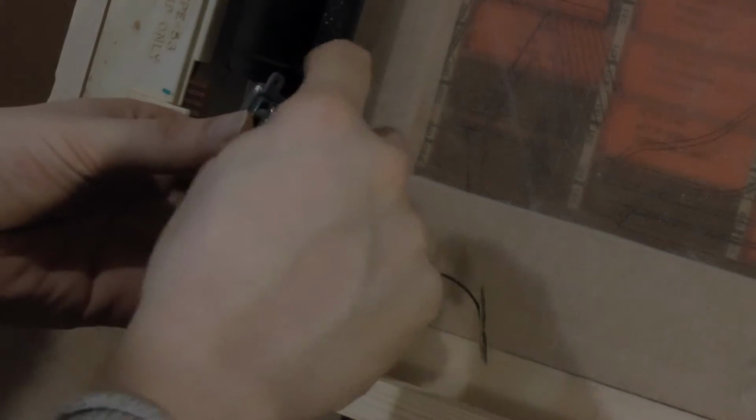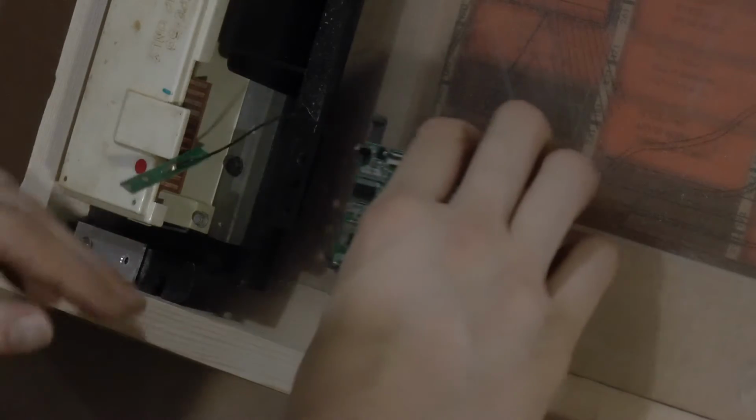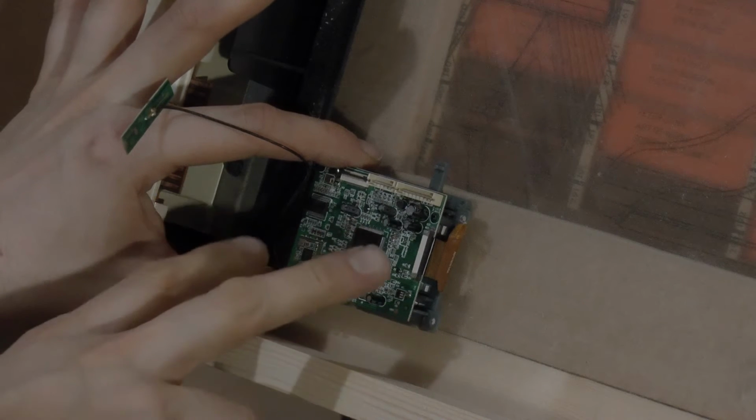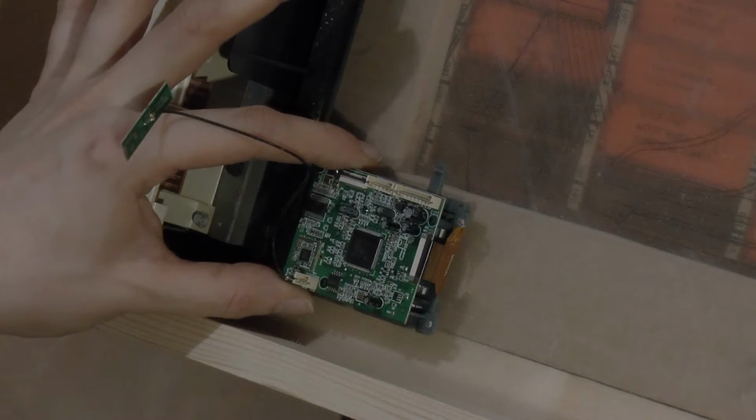But I've got to find a way of mounting it. Right, there's a few ways I could do this, but I think this is going to be the best. This is the indicator lights for the record now playing. I'm thinking a piece of right-angled aluminium bracket bolted to the side of this screen, and then we'll make that up against the side of the indicator lights, and that'll hold it flush against the perspex. Let's give it a go.